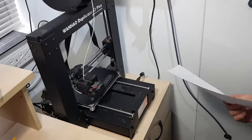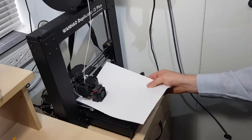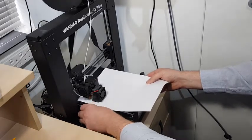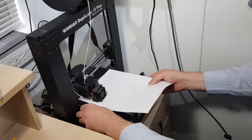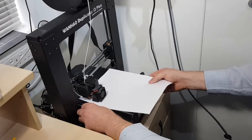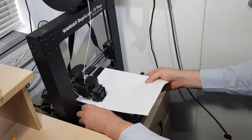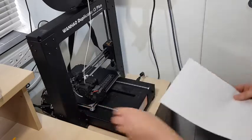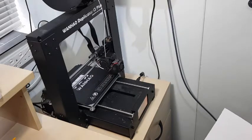Get into the first position, then slide the paper between the hotend and the bed. You can see it's free to move here, so that's a bit too loose. Adjust until it moves underneath but with a little bit of friction between the two — that's what we need to achieve.